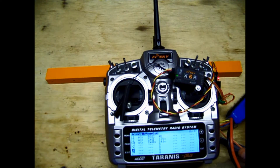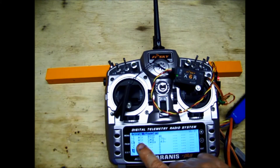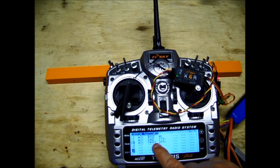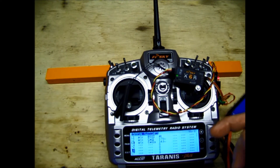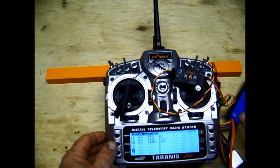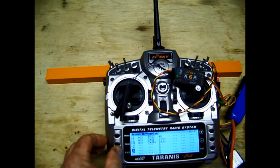This is actually set up for a four-cell pack, and that's why we're getting the warning on the three-cell pack voltage but not the individual cell — because my lowest cell is only 4.12 volts. It's not going to notify me until it drops to 3.7. But since the pack voltage is set up for four cells at 14.8V and this is a three-cell pack, it's already registering that the three-cell pack is lower voltage than 14.8, so it's notifying me.